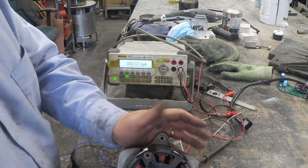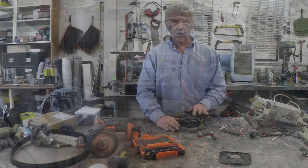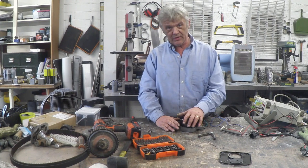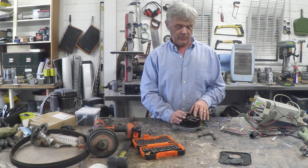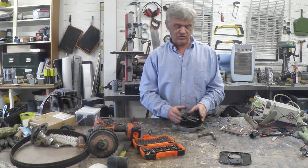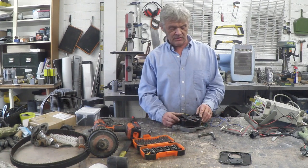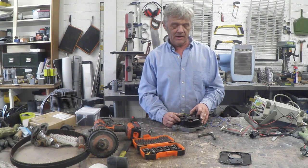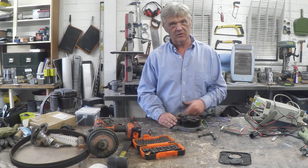Clearly we need some mechanism on this to get speed. The torque on this is amazingly low - it's really easy to spin it but it was meant to spin at very high speeds. So we need some kind of mechanism to get this spinning fast. The real benefit of this is it was made for a car, so it's a real chunky beast. It's solid, it's sturdy, it's got good bearings. It was the electrics that blew, nothing else. So this is in really good condition and can take that kind of modification.